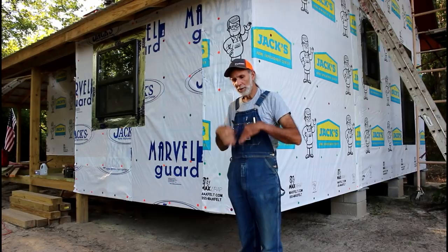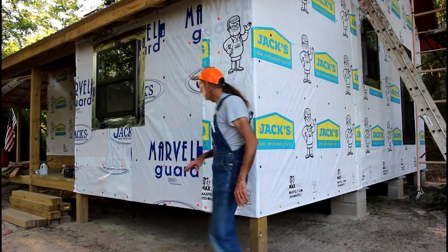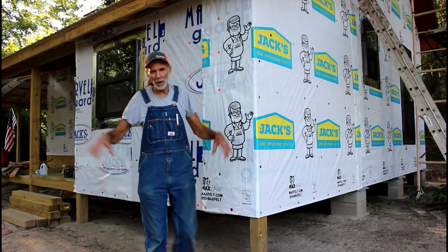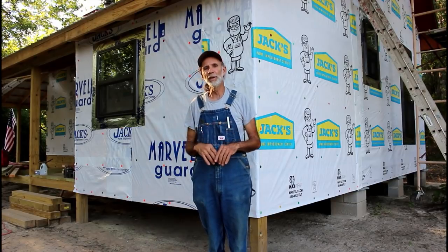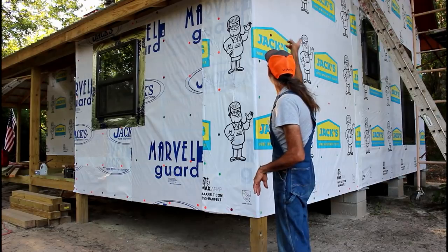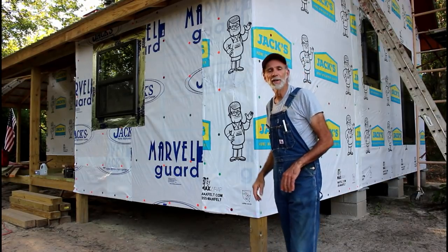We peeled the house wrap on the inside, tacked it off. I put all the window tape on. I window taped the bottom of the sills like we always do. I window taped around the window to seal it off completely. We got that done, and then I went ahead and run the harness work out here to a certain point and got the soffit in.